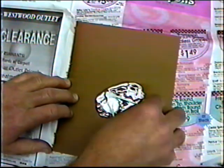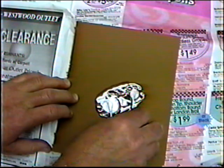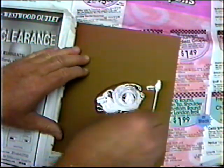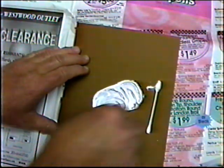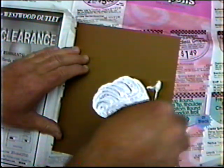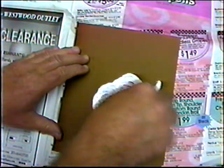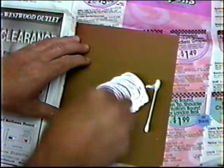I'm mixing up a little batch of 5-minute epoxy because I want to seal this mold. It has been used over and over again, and I've made a lot of these gear legs for customers, and it's really getting worn out. But I want to make a thick paste. I want to put a little bit of white dye in. That'll help in terms of the finished part, if we buff through in a little spot or run through, you won't wind up with this giant eyesore of a color coming through.